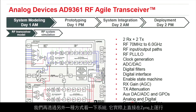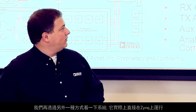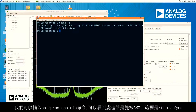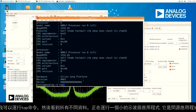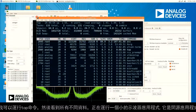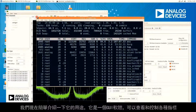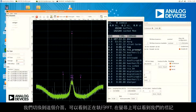So we can flip over and look at the system running directly on the Zynq. We can see UNAME says Linux on the ARM. Catting /proc/cpuinfo shows it's a dual-core ARM — a Xilinx Zynq. Running top, we can see the OSC application running, which is an open source GUI application for looking at and controlling things.